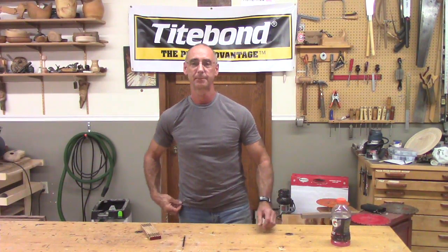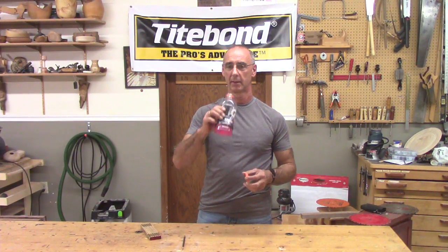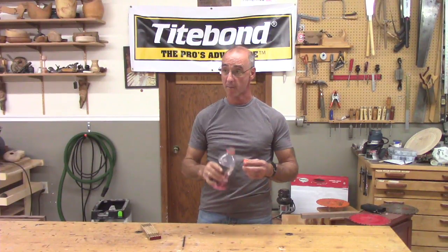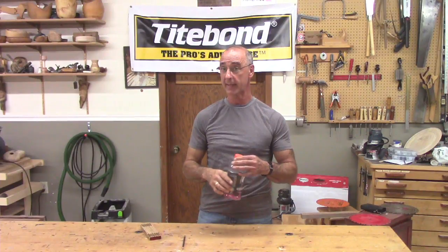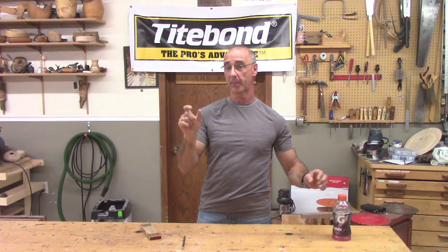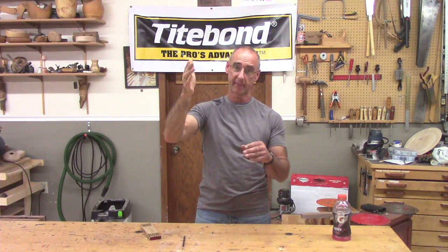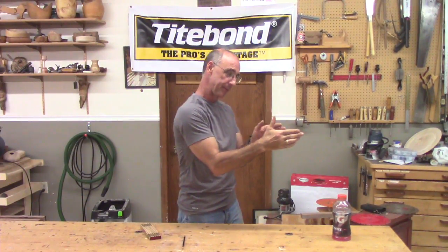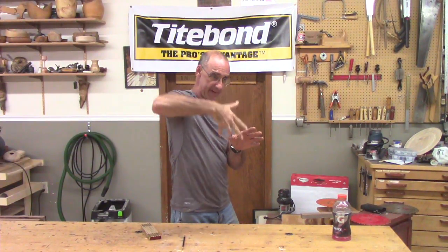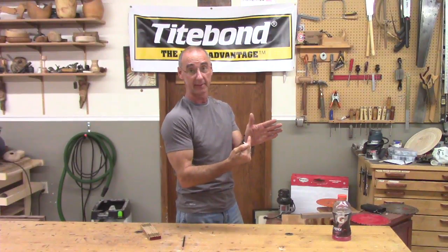Okay, Garth says, do you have any hints or tips on using lock miter router bits across the end grain of wood? I have tried, and with the grain on the edge or face is okay, but across the end grain is not working out. Yeah, so I know we have this video on GOA. When you take that vertical piece and stand it up and run it along the fence, you've got the face going this way and the bit going this way. What typically happens is that it chips the heck out of that face grain.